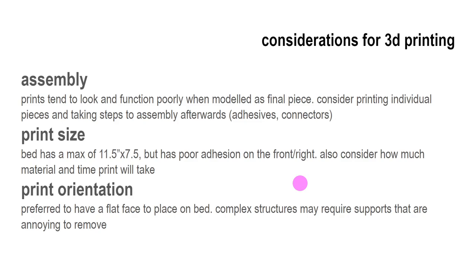Considerations for 3D printing: if you have moving parts, most of the time we have to print them separately. If you model everything as one big assembly, they're not actually going to move. Some printers have dissolvable supports, so you could print a ball bearing and dissolve the supports — we don't have one of those printers. If you're really good at 3D modeling, you can model breakable supports built in — like those fidget slug toys that make a rattling noise. Those just have breakable supports in them.